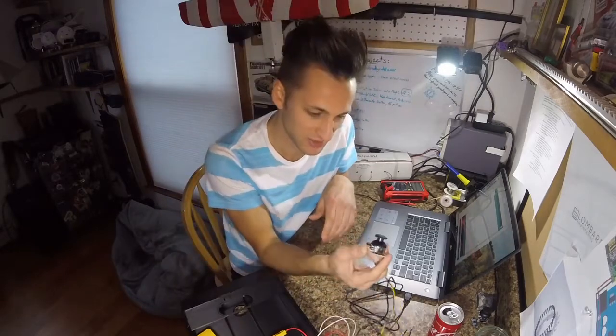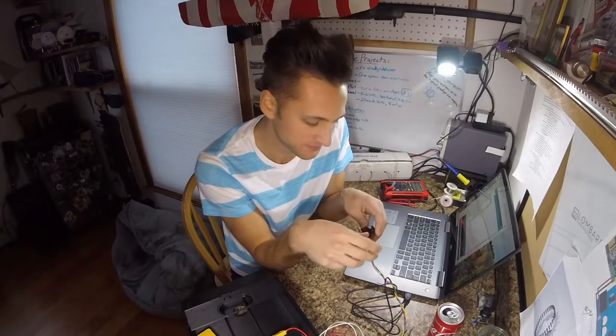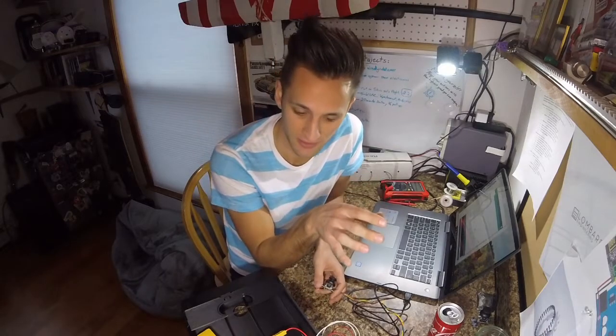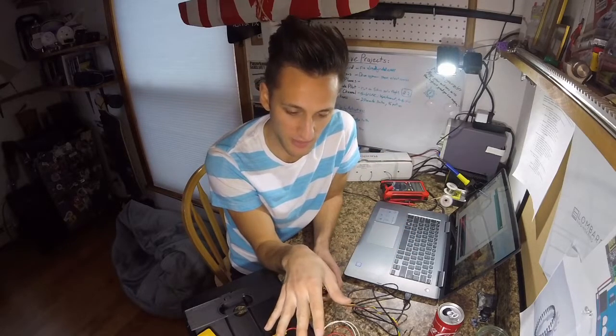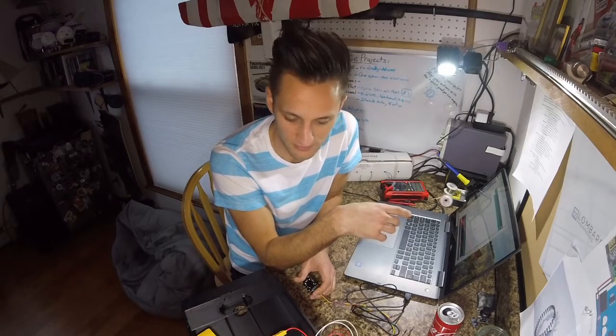I'm a little heavy on the controls because I programmed a dead spot in so that it wouldn't always be making the PWM noise, and it's also a tiny controller. But this indicates success, which is fantastic. From here I'll be moving on to getting the turret so I can control it back and forth, get the servo in there, elevate the gun up and down. I'll also be painting the Maus and then working on getting an RC circuit worked up so I've got the receiver in the Maus and a transmitter outside. I'll be posting the Arduino sketch I used today, though it'll differ greatly once everything is done.